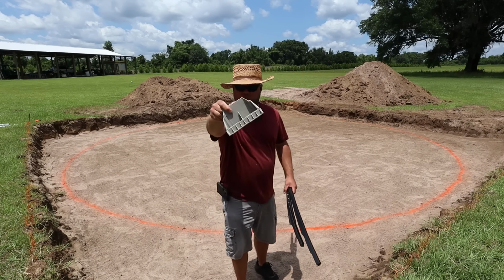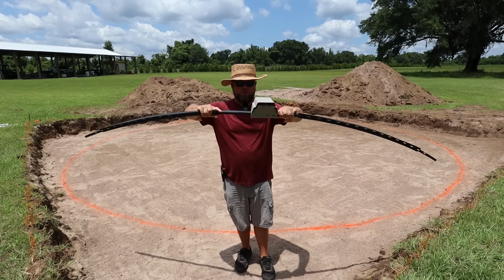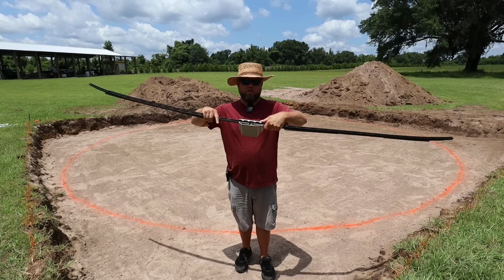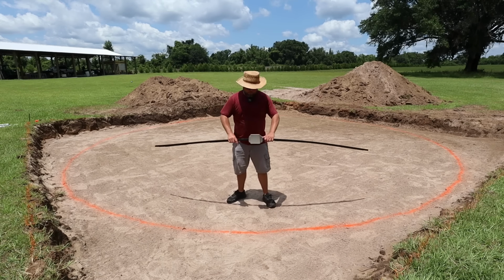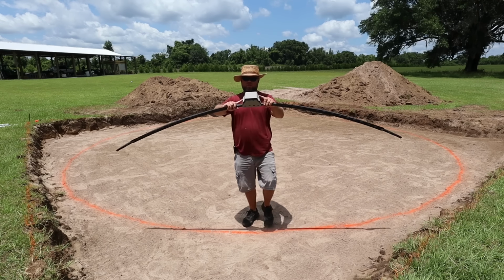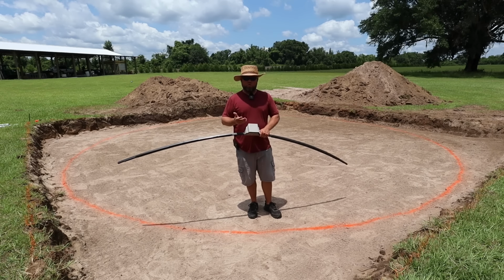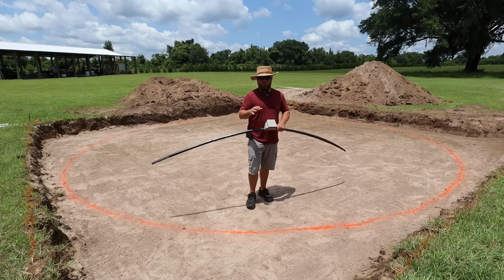We have the bottom plates for all the uprights that's gonna support my pool walls. And what snaps into these is a track that ultimately holds the wall. You can see these are already concaved and bent, although they can be manipulated some. So I'm gonna have to go ahead, put all these down, connect them all together, build out the ring of the pool, and mark where every one of these post supports are. So there's a few different things that you can do to support your pool wall. Follow your manual because, well, ultimately you wanna stick with their warranty and be correct.